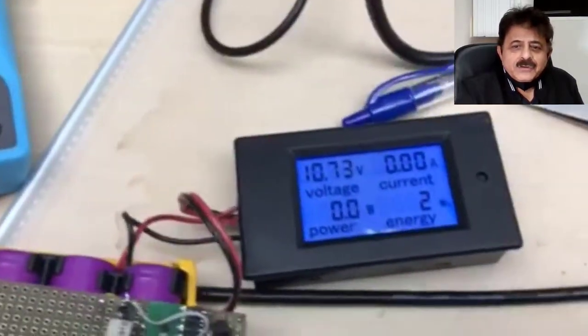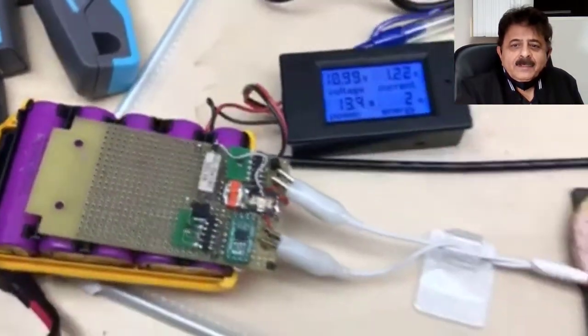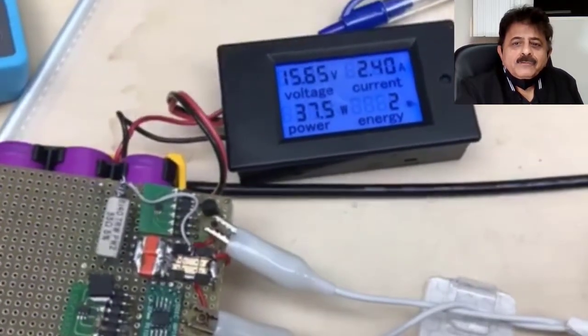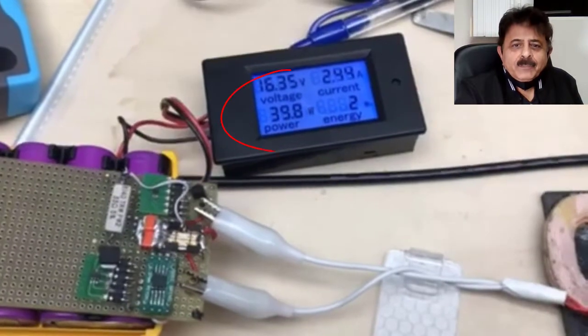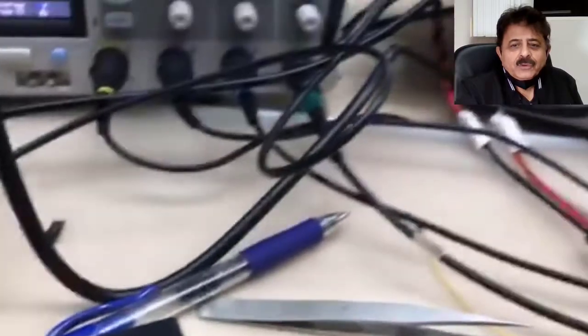I'm going to put the tiny coil on top of the transmitter coil. Now watch the voltage ramp up very slowly, and as it ramps up it'll suddenly start drawing power. It's limited to about 2.4 to 2.5 amperes current limit, so it'll settle to whatever voltage for that current but no higher than about 20.4 volts — so it'll end up in float charge. The input draw is about 40 watts.